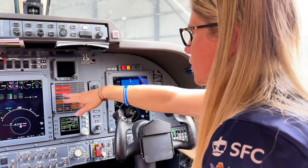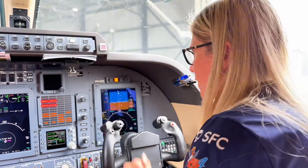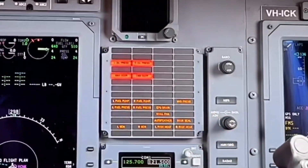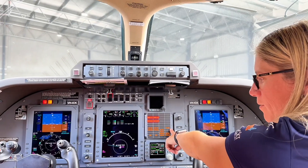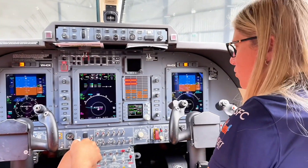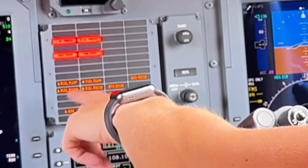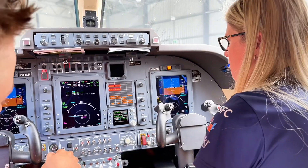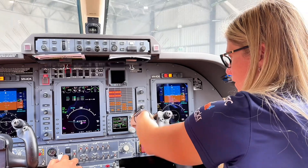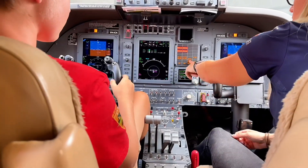We've got a red warning light because we've got no oil pressure. The cabin door and baggage door are both open — that's where you get a red warning light. The caution light is something's not in the position it's meant to be in. Hydraulic pressure is associated with the hydraulic pump — that'll be there if we don't have the hydraulic pump on, which means we don't have brakes and we don't have steering. You'll work out pretty quick because you can't stop or steer. You've got left and right fuel pump and pressure — those are fuel pump switches we have to manually have on. Left and right generator, making sure we've got generating there. Pitot heat is critical for this aeroplane — we've always got to run with the pitot heat on, and that'll also get rid of our stall fail light.